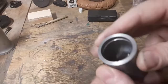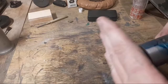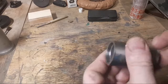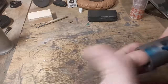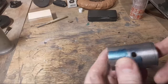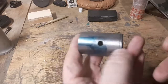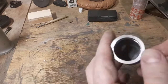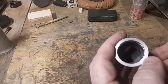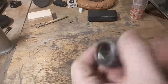So this still has to be 2 millimeters smaller on the outside, and I'm going to make a boss to fit that over, and then a D-bolt to go on the gudgeon to screw it on. With a tapped hole in the boss, so that this runs nice and true and we can machine all of the outside at once. So that's the idea, to machine that down, I think it wants probably another 100th off it, something like that. But I can't do anything until I've bored the cylinder, so we're just doing this while we're waiting for a milling machine.